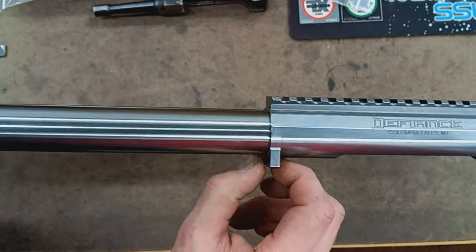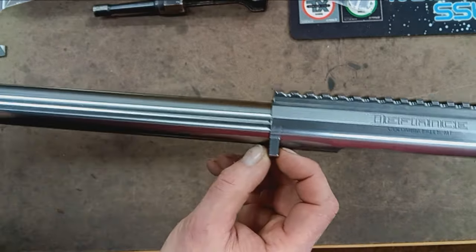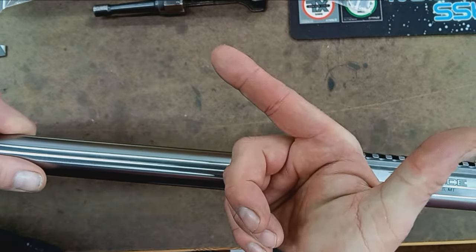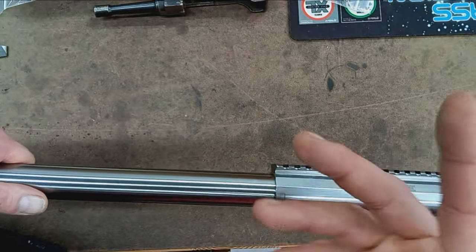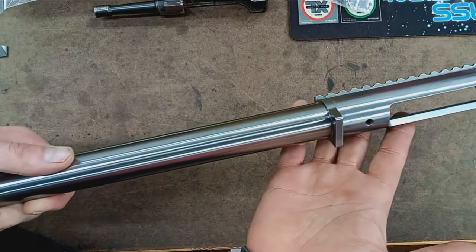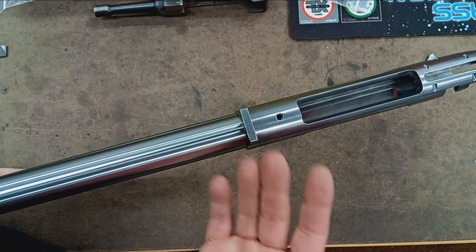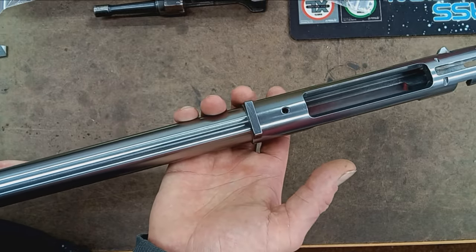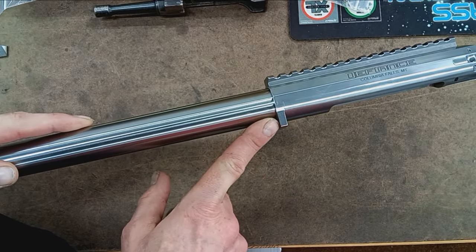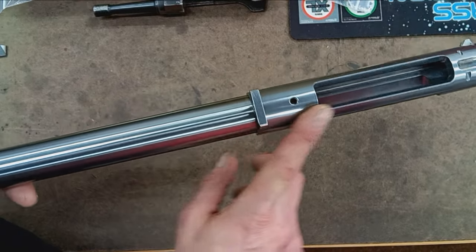Earlier in the video, I measured this. I think it's 1/4 inch thick. And the stock has inletting, or the bedding was bedded around the original Remington 700 standard recoil lug, which is 0.187 or 188, which is 3/16. So this is 1/4 inch, and the old one was 3/16. So obviously this is not going to fit until we cut out some or most of the bedding.